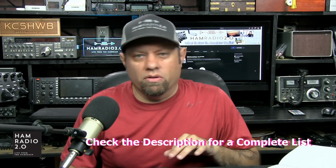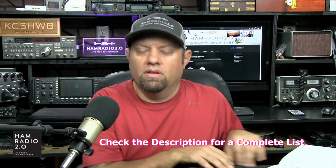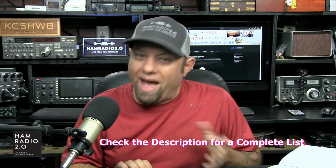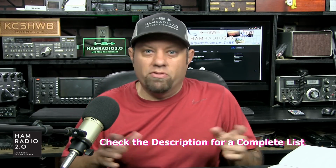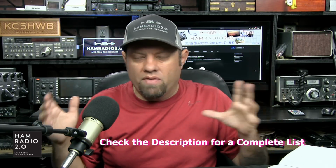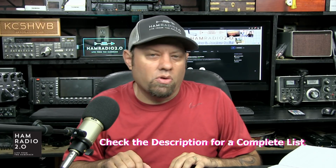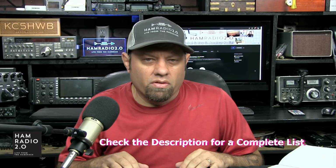They have better receive sensitivity. They have better front-end filtering. So in other words, when you're talking on one band or listening to one band, you're not going to get what's called intermod or desense from another band. Some of the lower-end models, you have that problem. If you're in a major metroplex area like I am, Dallas-Fort Worth, and there's a lot of different RF signals from various bands, amateur radio, police and fire, a bunch of other commercial stuff, you can sometimes get an overloaded front end on the lesser expensive radios, and you get what's called intermod or desense.